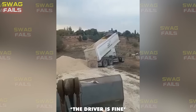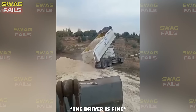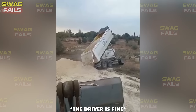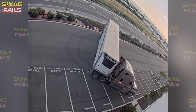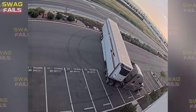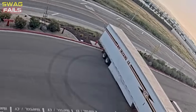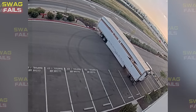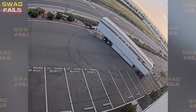Do not miss the inclinometer in the cab so you know how level the truck is before raising the box. If it feels uneven, do not lift it up or it'll tilt somewhere else. Before turning around, find a safe and large enough location to do so, ensuring that you will not destroy infrastructure, such as fire hydrants, in front or behind when you turn.